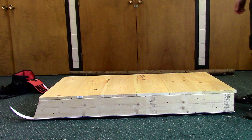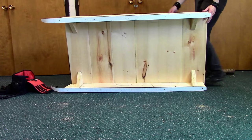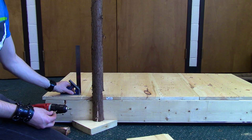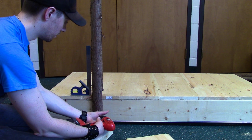At all, I had the base of the sledge put together. The base is 2.5 feet wide and 5.5 feet long. Using the small cedars I had harvested, I constructed the railings and supports.